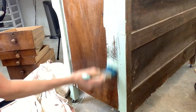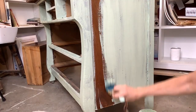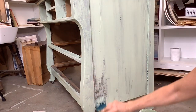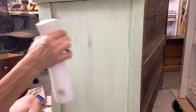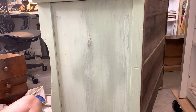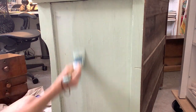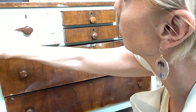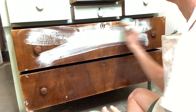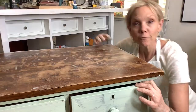For all the really flat large surfaces, I'm using the new DIY Paint brush called the Feather. Brushes are as soft as makeup brushes, hold a ton of paint, and you'll have very few brush strokes. Start at one end or in the middle on a flat surface and pull the brush all the way down — don't do lots of small back-and-forth strokes. When you're finished, wrap your brush in plastic wrap to keep it airtight until you're ready for the second coat. I like to spray a little water from a continuous mister bottle — this allows the second coat to flow nicely over the previous coat with practically no brush marks. I'll repeat the same on the drawer fronts.